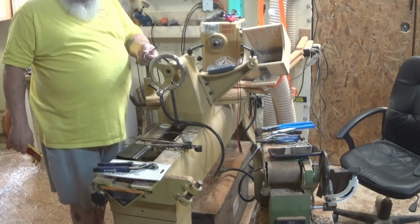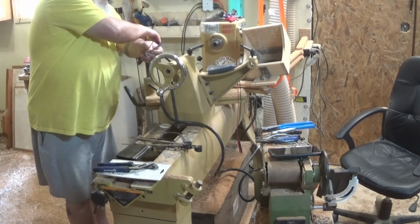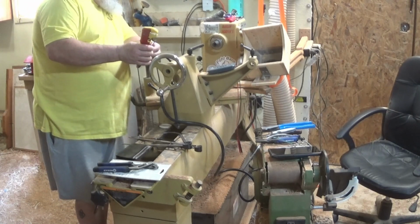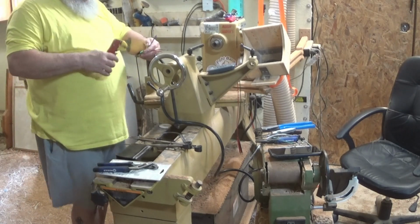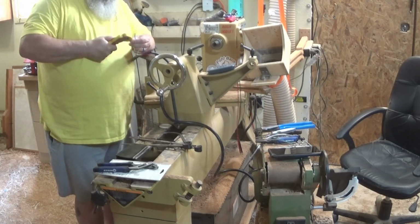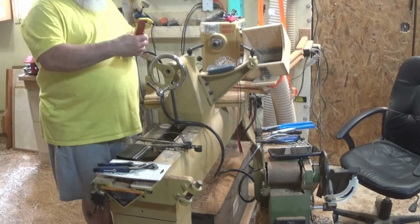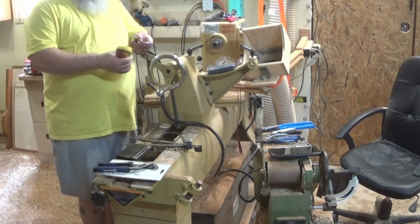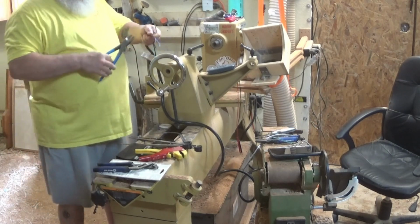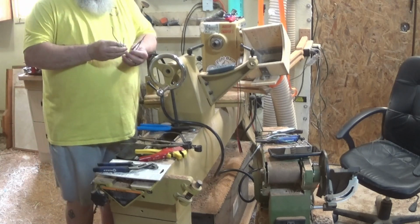Now if you remember, this wire bundle or cable has 7 wires. More than I need, but I do need 6. 5 for the inside and 1 going to the ground. I've got green, white, and yellow done. I need blue and black. I don't have black, but I have brown or purple. So I'm going to go blue and brown. So brown will go to black because it's kind of close. And that leaves me 2, red and purple. I don't want to use a red wire for ground, so I'm going to use this purple for ground. That said, the red wire isn't needed, so to keep it from being in the way, I'm going to cut it off. So now I've got the 6 wires that I need.